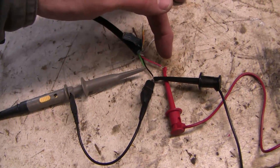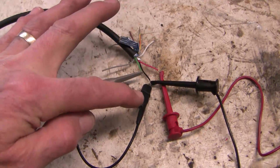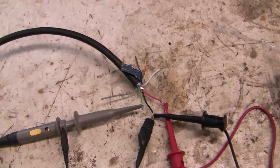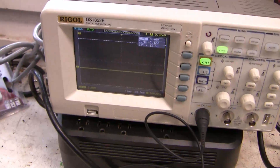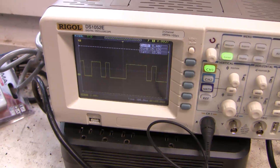My power is hooked up to the red wire — the power wire — and black is ground. I've got my oscilloscope hooked up to ground, the sensor wire is green, and the temperature sensor wires are not hooked up. As I flick the paddle wheel you can see I get the same kind of square tooth pattern that I expected.